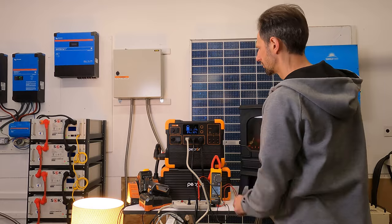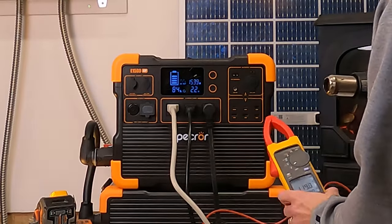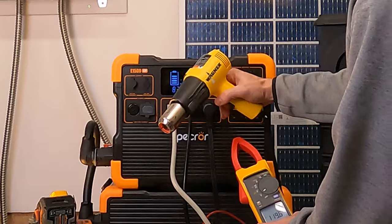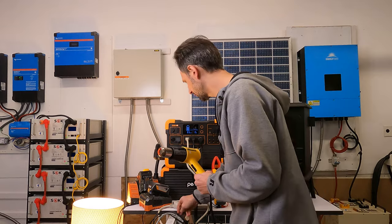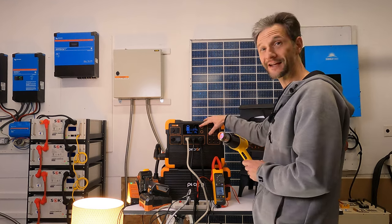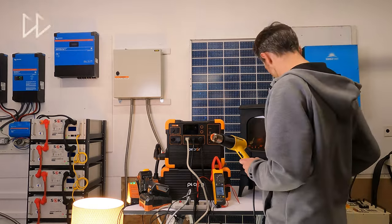The heater. All right, there we are at 1,000 watts. 120 volts right on, 1,500 watts. 2,178, 119.6, perfect. Got some other random loads I can plug in here. The light, I should push it over, almost right at, oh, there we go, 2,277. Hey, it's holding over target there. See how long it can do that.